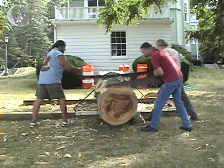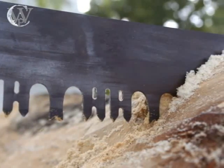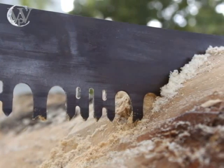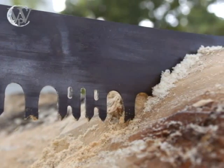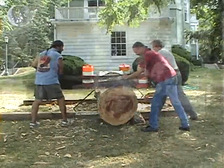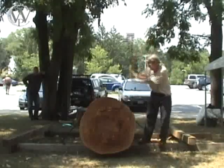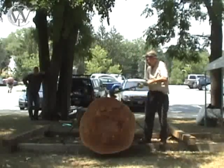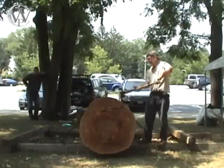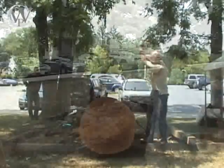The idea was to cut notches along the edge of the tree and then split off those chunks to create a flat surface — taking the round to the flat. I tried chopping notches along the wood using an axe, and that worked fine, but it took about eight minutes to chop out a wedge of wood down the four inches we needed to reach the flat spot.